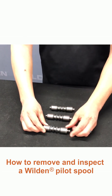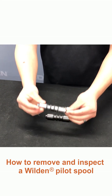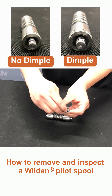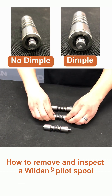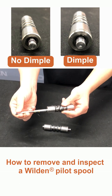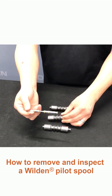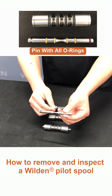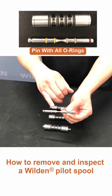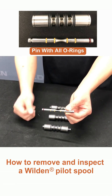To inspect the pilot's spool on the inside, we're going to want to remove the O-ring that is opposite the dimple. Once we remove the O-ring, we're going to be able to slide it out. There should be a little bit of tension that you should feel for a good pilot sleeve assembly. What we want to do is inspect our O-rings: the outer one, your anti-double-shift ring, and then your three inner rings.